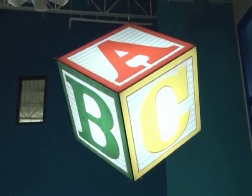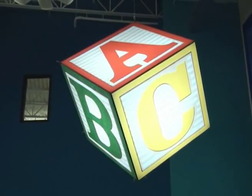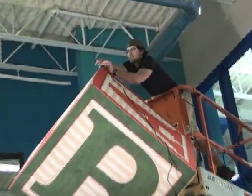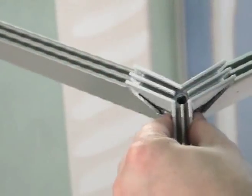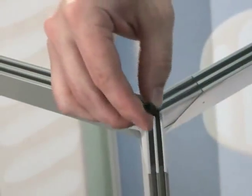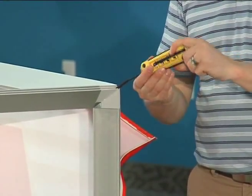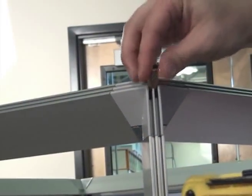For diamond cube installation, follow the installation steps for building the PictureCube frame. The diamond frame has a corner package that contains a hang corner with double eye hooks; a cable can be applied to the top corner for hanging the assembly. To keep the cube from spinning, an anti-rotation eye bolt can be added to one of the corners. This eye bolt should never be used to hang the PictureCube frame, as it may unscrew by turning up the structure.